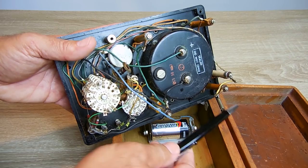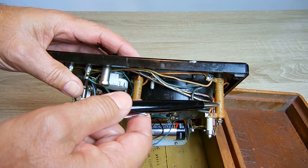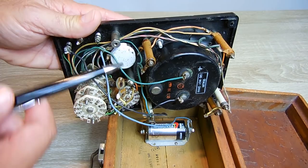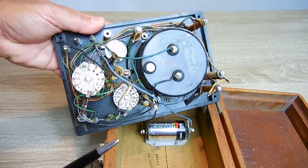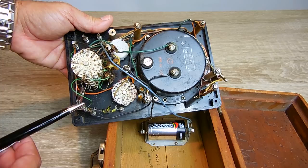Over here, all these are resistors. You can see right here it's a wire-wound resistor — this is 800,000 ohms or 0.8 megaohms — and I think this was a 50K. You can see the potentiometer right here, a multiple level switch, and over here is the other switch for changing between voltage and ohms. There's not too much else inside this unit.